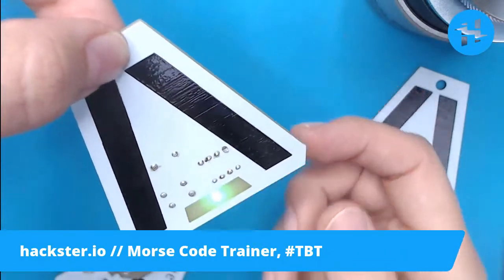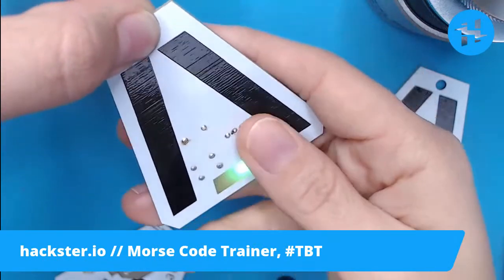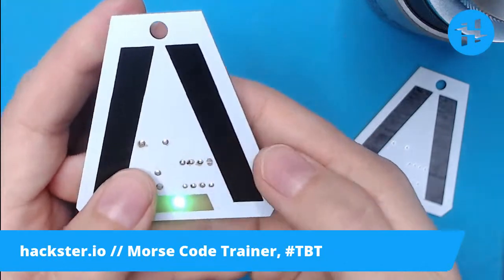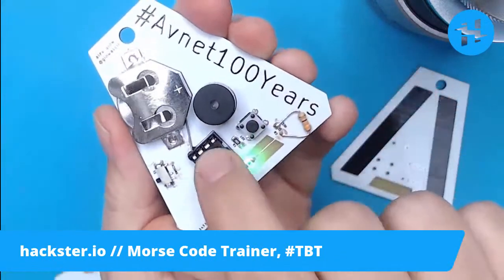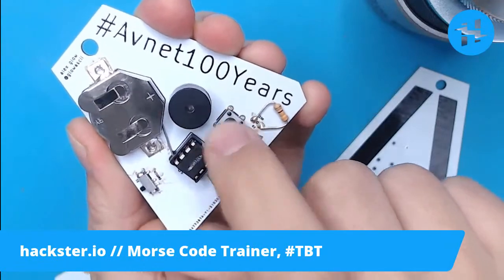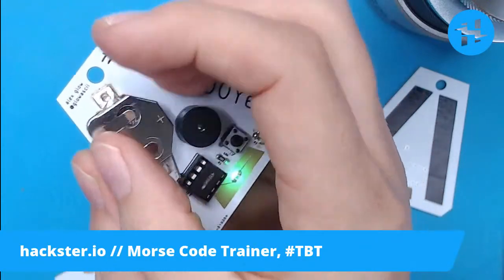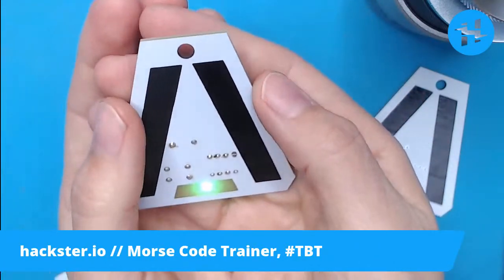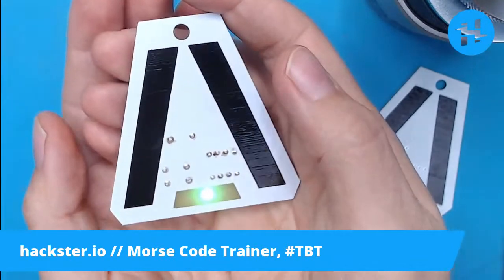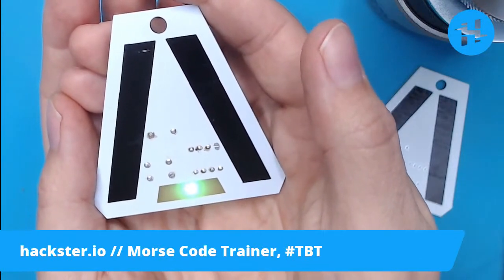This is designed as a badge, so I wanted it to be as low profile on the front as possible. I'd like future iterations to include surface mount components, so I've also ordered surface mount versions of the ATtiny85 chip that I'm using as well as this button. I haven't yet found a good SMD buzzer that would do the job. You can find the entire tutorial linked in the description to this video.